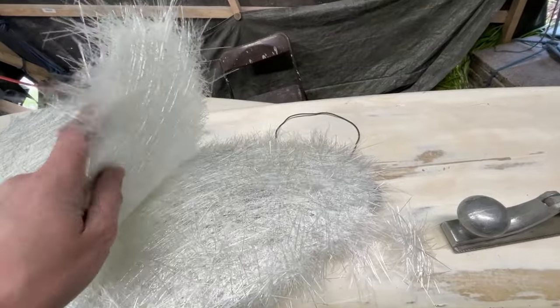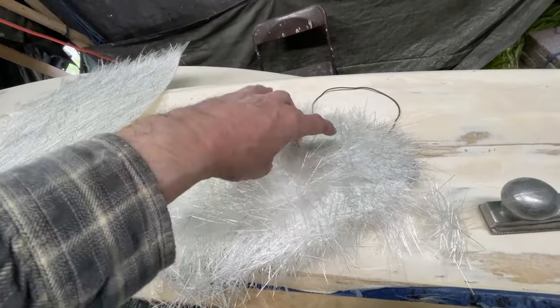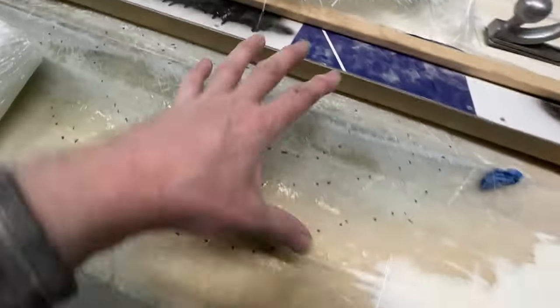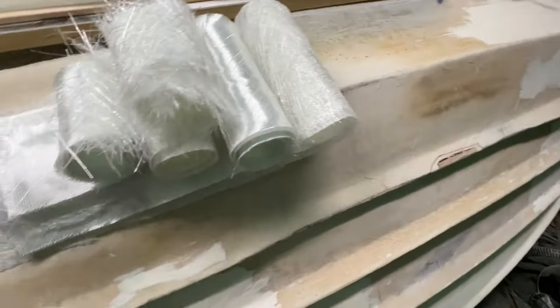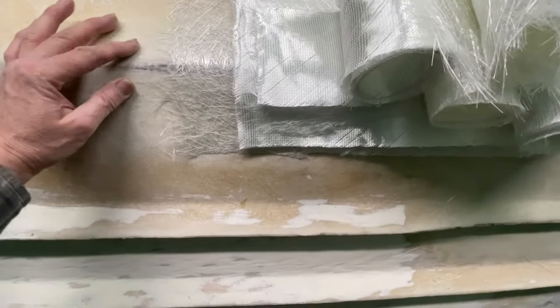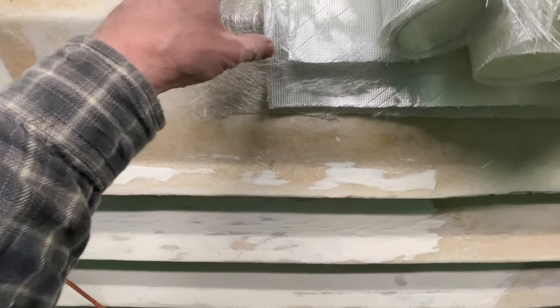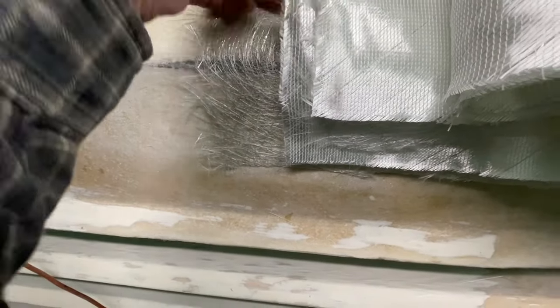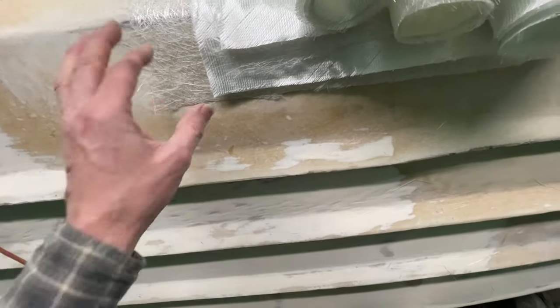So now I prepared the fiberglass here. I think, remember, it's 600 grams. Quite thick. 3 pieces. Here, and I also prepared for this area, the bottom area here. This is only 90 grams, very thin, because I want to have this woven material on. It's the cross woven. It's a very strong material. It goes this way and that way, this end.